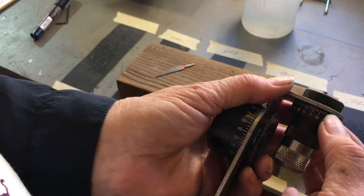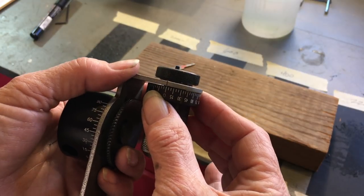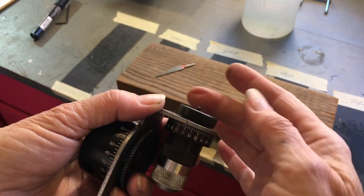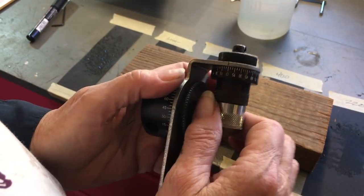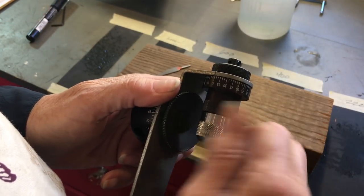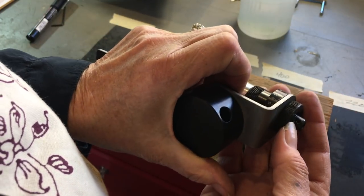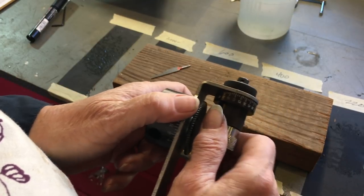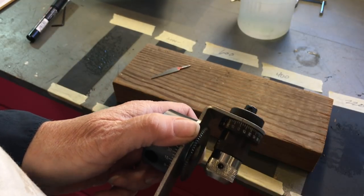There are numbers on this dial. You want to put that on zero — I'm kind of holding the two pieces together. This knurled knob up here turns and tightens down, so you want to set that at zero. Next, we're going to work with this knurled knob — each click is a 45-degree turn. Our goal is to line the set screw here up with the zero here, which should be about two or three clicks. Now I've got the set screw lined up with that groove.